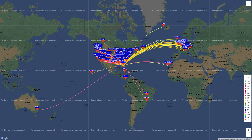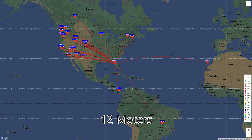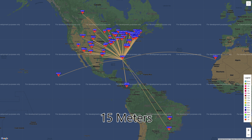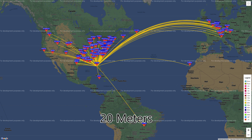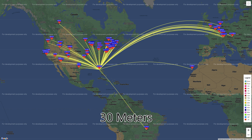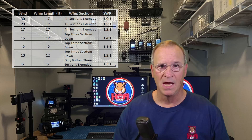Here is the chart with all of the bands we're operating on. Let's look specifically at 10 meters, over to 12 meters — everything's looking pretty good, what we're expecting. 15 meters, over to 17 meters, next up 20 meters, and finally 30 meters. Operating 30 through 17, I had the SS-17 fully extended per this chart. I completed that whisper testing to my satisfaction, then moved on to 15 through 10.